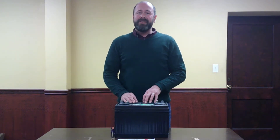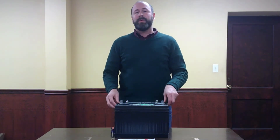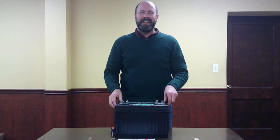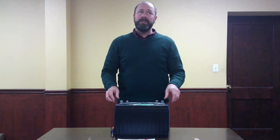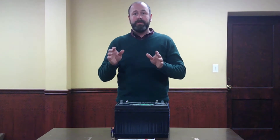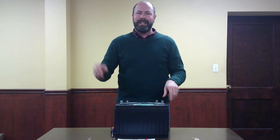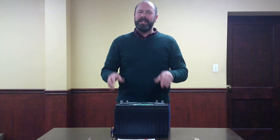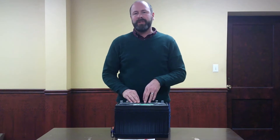Number two is don't let your batteries run all the way out. If you're running an auto scrubber or sweeper or whatever it is, try not to run it all the way until it's completely dead. Do that enough times and that's really hard on lead acid batteries. And number three, if you're not going to run your equipment for a while, charge it completely full before you take that piece of equipment out of commission, because lead acid batteries lose their charge just sitting there and that will also kill a battery.